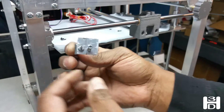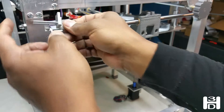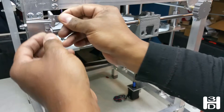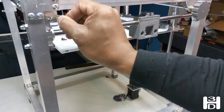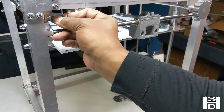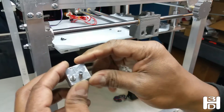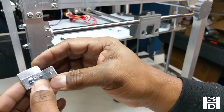This is the piece of aluminum I add to the back. I've drilled a second hole for a rivet, because even though this screw will go through — and this is just a temporary screw — we'll use a longer screw that we'll put a wing nut on, on the front side of the frame, to allow for tensioning the belt. The size of this should fit snugly above the SHF-12 and the top of the frame, enough to allow this to slide back and forth, but tight enough that once it's at the top of the frame it won't be able to turn. Because this only had one point of attachment, I ended up drilling a second hole between the nut and the corner of the corner bracket to accept the rivet.